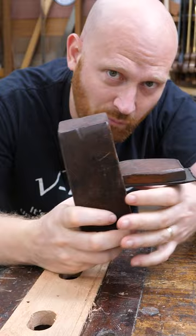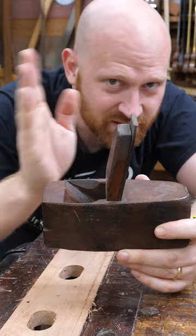There are a bunch of other uses for the toothing plane — if you have one you like it for, let me know in the comments below. The big reason for the blade being vertical is you're going to be able to go across the grain, against the grain, and in odd directions, so you're not going to be leaving a lot of tear-out, just a roughed-up surface.